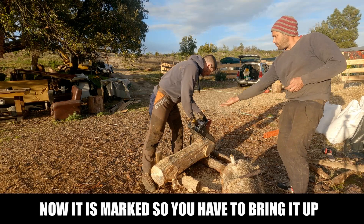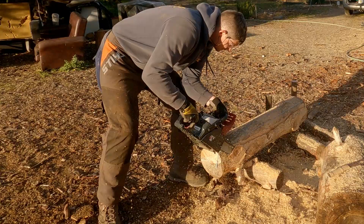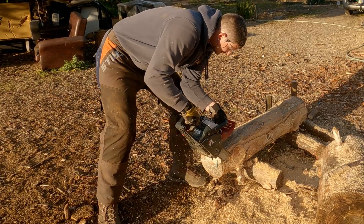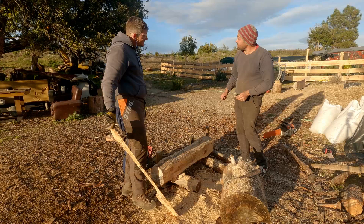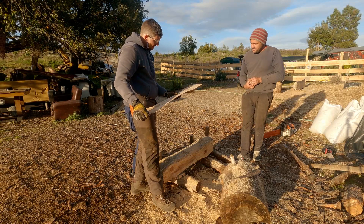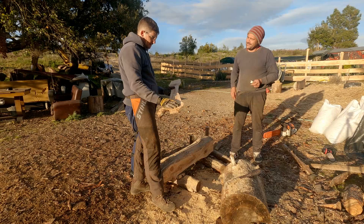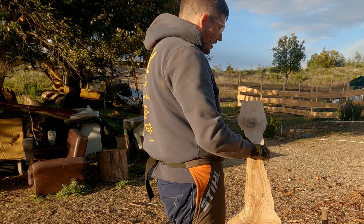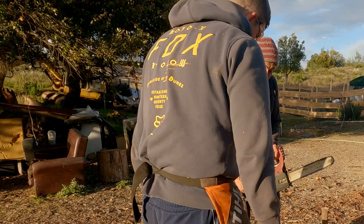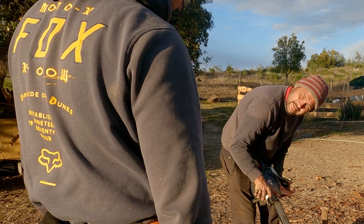Now it's marked. It's pretty smooth — look how quickly it happened. With a deeper log with the Stihl it's even more so. Take off the guide — that first bit is your first board, look at that! Very good, man. You really feel it on the knots, don't you? Much harder — I was quite surprised by the resistance on the knots. At the end, using just one or two teeth is even better — it cuts more and rolls nicer.